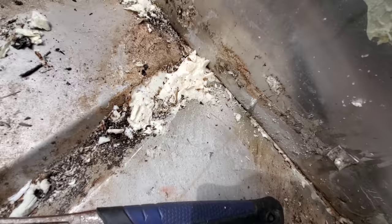Problem is, guys, this carpet has grains and the light reflects off those grains and forms a different shade of gray depending on which way the carpet is facing. And that's how boats look like somebody that didn't know what they were doing did the carpet job. And that's where you get 50 shades of gray interior because all the parts are cut from a different side of the carpet and facing a different direction. I don't know if that makes any sense.